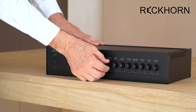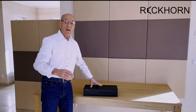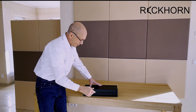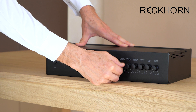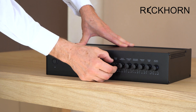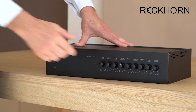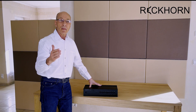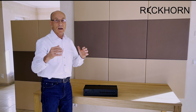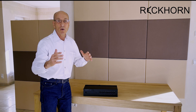After the high cut, we have equalizers. You can boost some frequencies if you have a smaller subwoofer and you're not happy with the low bass sound pressure. You can boost at the frequency that you want — one setting is the boost level (how strong you boost) and the other is the boost frequency (where you are boosting). Be careful: boosting means you're pushing much more power into your subwoofer.